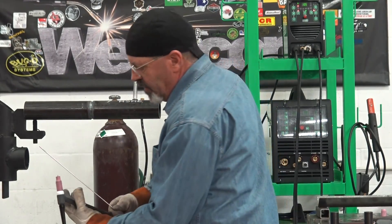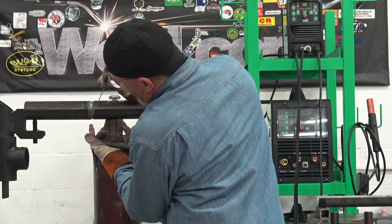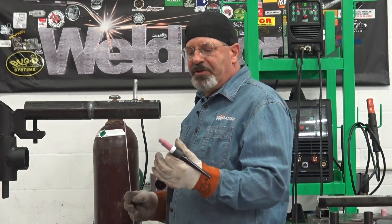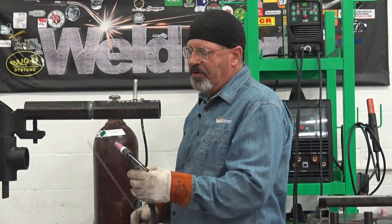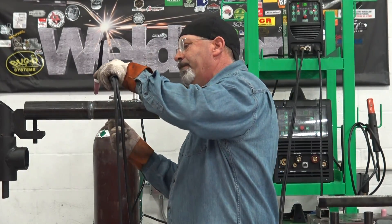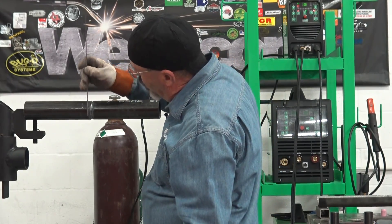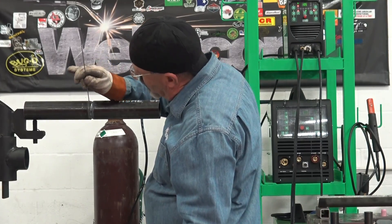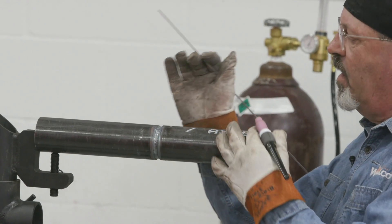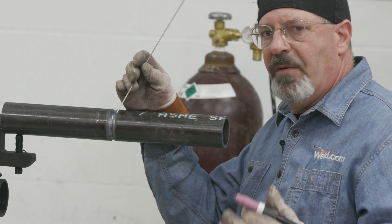You can put your fingers against the pipe — same way. Any way you brace and prop and come up, get comfortable, make sure you're not violating a good torch angle. You wanna reference the center of the pipe all the time, leading angle slightly. Same thing with your filler wire — you want it on the leading edge of the pool, you wanna be in control. This is a small bore pipe, so if it starts heating up you may have to use TIG fingers or a heat pad or something. But it's all about comfort — you guys can do this.